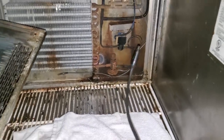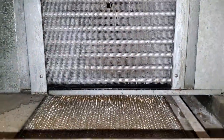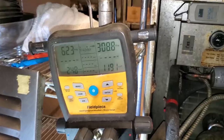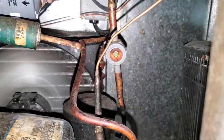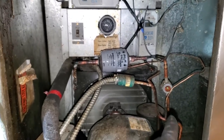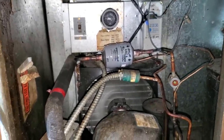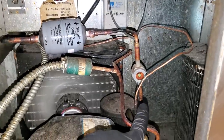We're going to go ahead and put this guy back together and watch it come down in temp. There ended up being a pre-filter on this condenser — I have a light on the other side and you can see it's nice and clean, you can see right through it. So we're going to let it run for a bit. It's very important that you don't clear the sight glass under a super heavy load. I leave a few bubbles in there every once in a while, and then as it comes down to temp, more than likely that's going to clear up, or I'll add some more refrigerant — but you could potentially overcharge this unit.